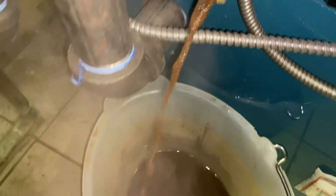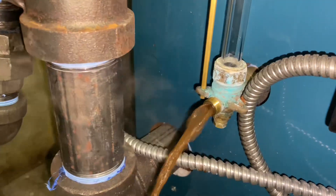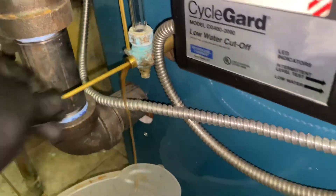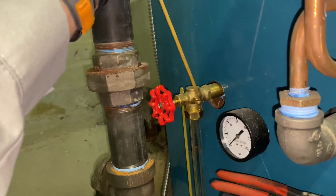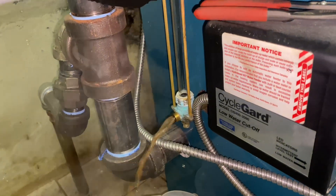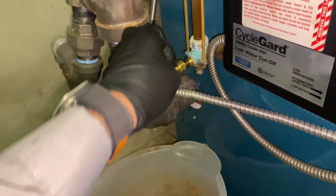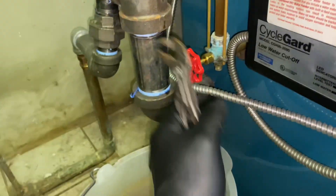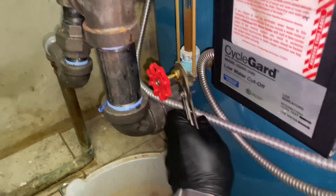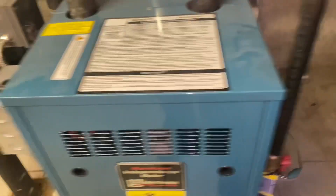She's clear now — so we're going to get a good sense of the water level in the boiler now that it's clean. I'm going to put the handle back into the valve, make sure we go back just a little bit like that, then tighten up the packing nut on the valve. Now I'm going to go back and finish draining — I want to get that as clean as possible.